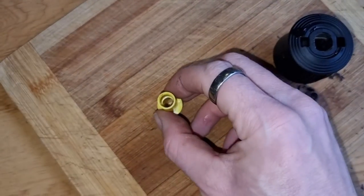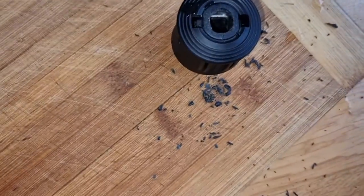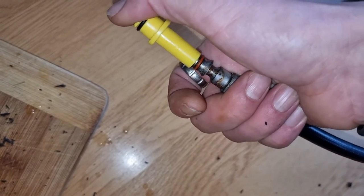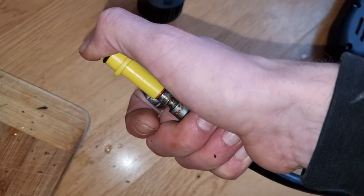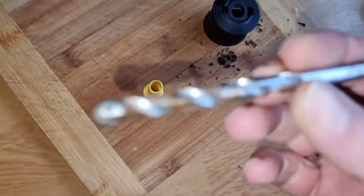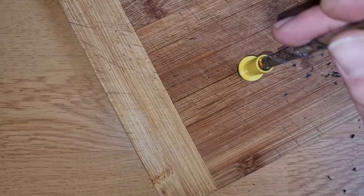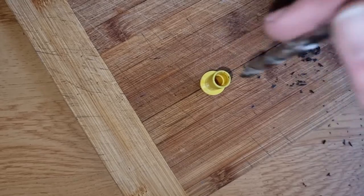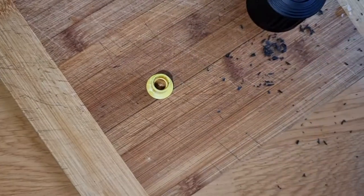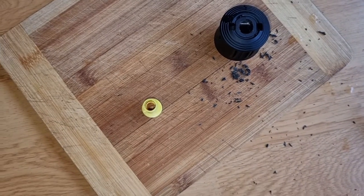So that fits onto here — that's one problem out of the way. The next problem we've got is this tube. It doesn't need much to get it over this lip, but I'm having to put quite a lot of force on it to slide in. What I'm going to do — I've got a 9mm masonry drill bit which sits snugly in there — so I'm just going to drill this out just enough to make the pipe fit, so it's still snug on the o-rings.